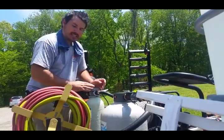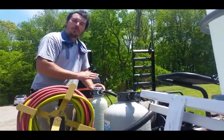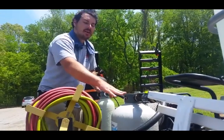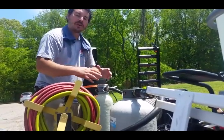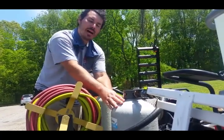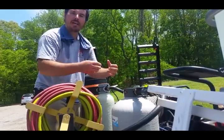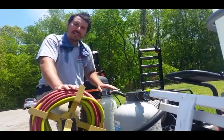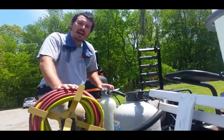But like I said, I do that because it makes this resin last longer. And the resin that's in the deionization tank, you can't recharge it like you can with the water softener. The water softener, you can recharge using salt and agitation and time. You put the salt in there and shake it around, and the point is that you don't have to replace all the resin in here every single time. You can recharge it using salt, which is pretty cheap if you buy it by the bag of the big granules that are specifically for water softeners. But the deionization tank, you have to dump all this resin out and replace all the resin every time.